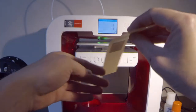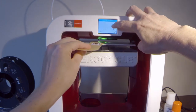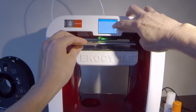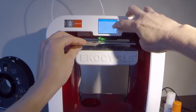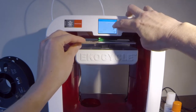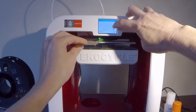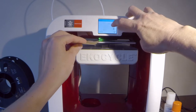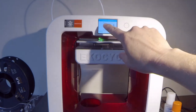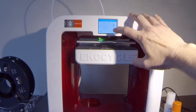And then what this auto calibration is for is setting, I like to get it close. This isn't your Z gap. This is where you tell the printer where you'd like it to perform its auto calibration functions from. So it isn't necessarily home. But what I find is if I get it pretty close to Z-gap, it does a much better job at auto-leveling and auto-gapping. So I've got that set. It's not even touching the print gap gauge, but I can see it's really close.